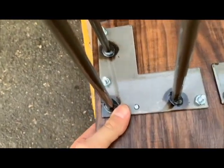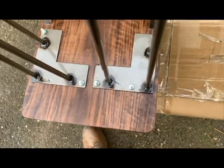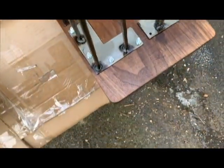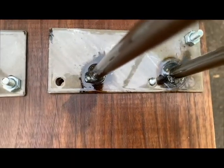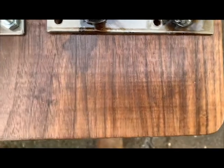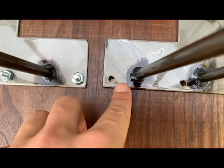So, some of the holes that I drilled in the wood are not perfectly lined up with the metal. That could have happened because I drilled the metal holes bigger afterwards, or just because I wasn't as precise. Doesn't really matter. Let's see if this one fits actually. Ooh, just barely not. So instead of re-drilling the holes in the wood, because I don't want it to be loose in the wood, I might just get my files and file out the holes